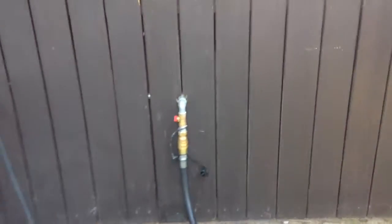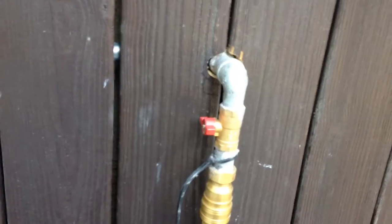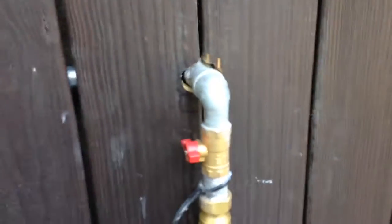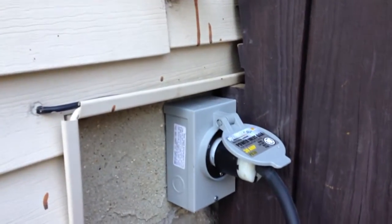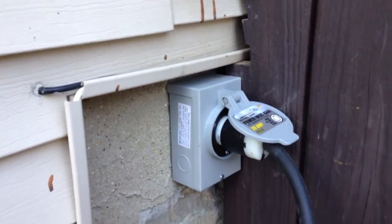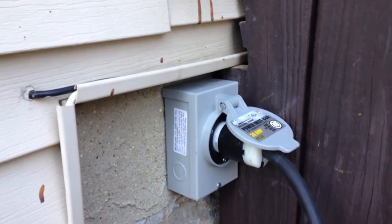This is a 20-foot hose I also got from US Carburetion. It runs to my natural gas line, which I ran recently from the basement. It has a quick disconnect fitting on there. Eventually this would also be for my barbecue — I'm probably going to put a T at some point and split one for the barbecue and one for the generator. And there's my generator inlet outlet. I figured this spot is perfect — out of the elements, under the siding.